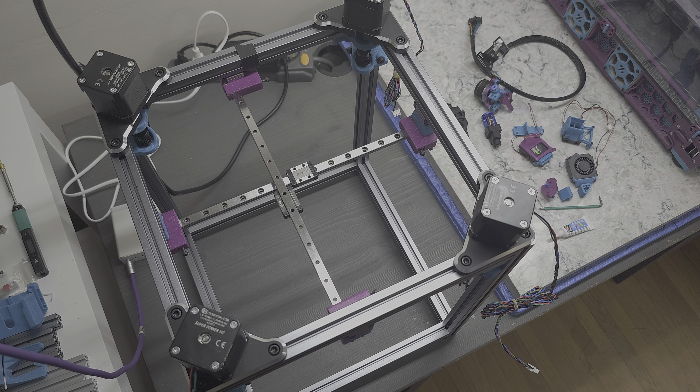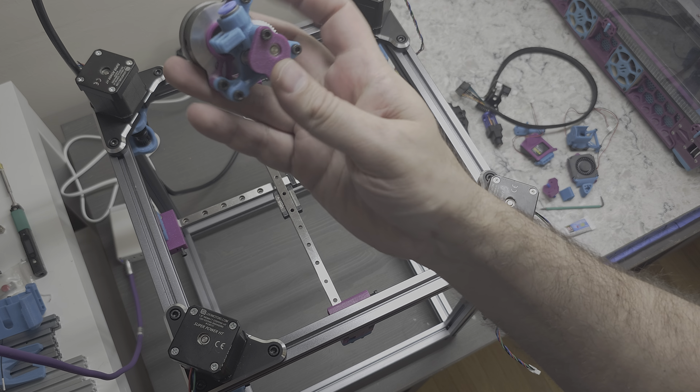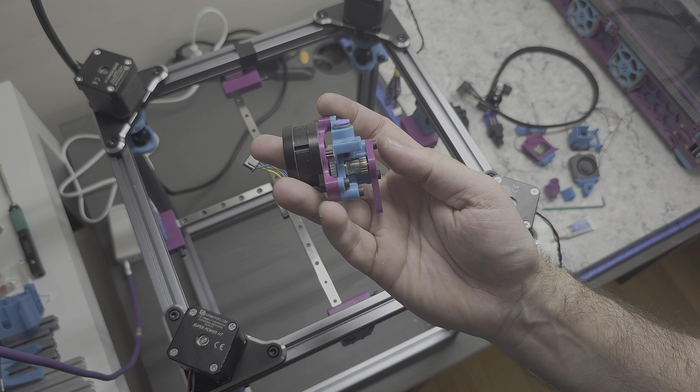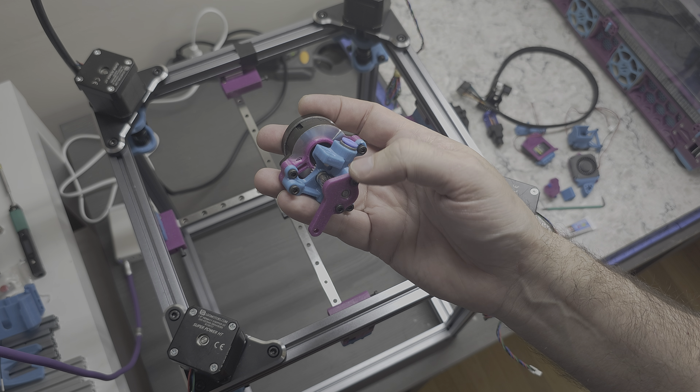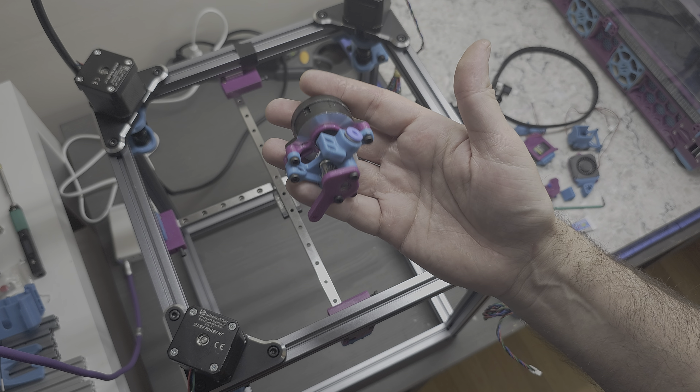Look forward to seeing that in the following video. Assembling the toolhead is going to be a bit of work — it'll probably be a slightly longer video even on time-lapse, and it's a little fiddly. I do have some sub-assemblies pre-done, so I'm not going to take apart and rebuild the extruder on screen — you'll have to look up how to build a Sherpa Micro. This is a modified version with some features I liked, but it essentially builds the same way as any other Sherpa Micro except for the idler tension arm, which works differently here — it's not on a swing arm.